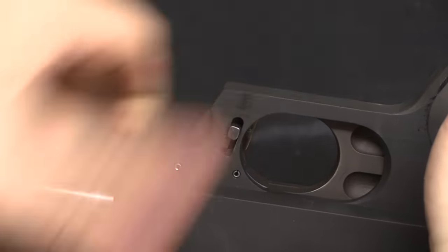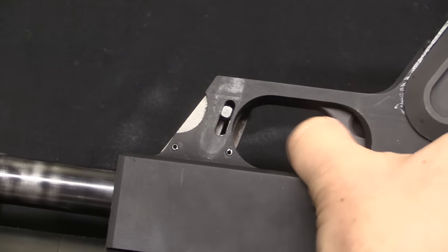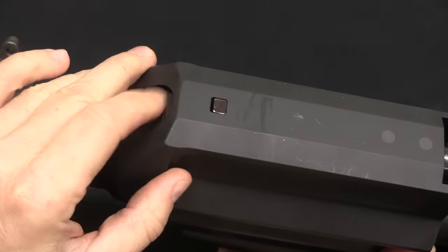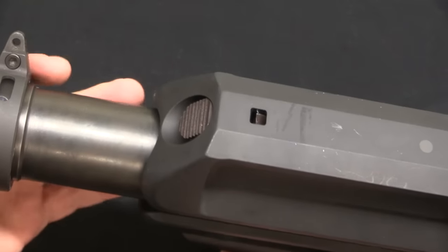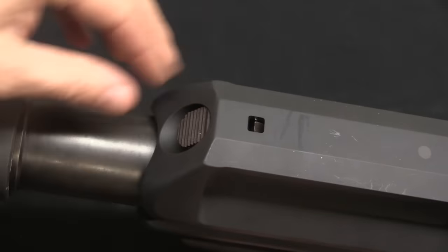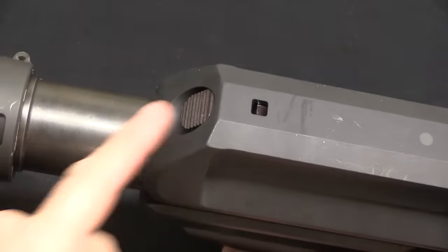The safety lever slides through to the other side. The trigger moves, and at the end of travel it is connected to this operating rod, but the trigger doesn't actually do anything — because at the back we don't have a firing mechanism for the trigger to interact with. The front of the pump handle has this spring catch on it, which I suspect is a pump lock. Keep in mind the functional gun is a semi or full-auto gun, so you don't have to pump it for every shot — the pump handle acts like a charging handle. So I suspect the idea was that to actually charge it you'd have to depress this button, so that if you were putting forward pressure on the handle while actually shooting, you wouldn't cause a malfunction unless you pushed that button.